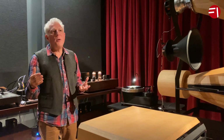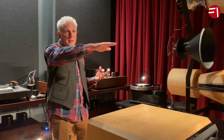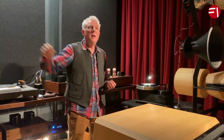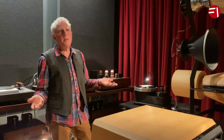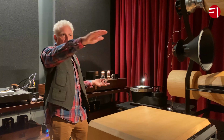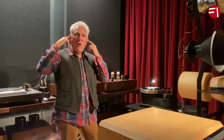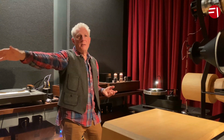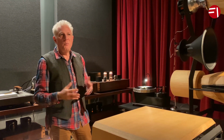In fact, one problem with the audiophile understanding of what sound should look like from a frequency response standpoint is this misnomer that the flat line, like a dead person's EKG, is the correct frequency response for a loudspeaker. And that's not true at all. If you look at Harry Olson's Elements of Acoustical Engineering, which was the textbook for most of the 20th century, you'll see that from a psychoacoustic standpoint, the way we hear, right? So our hearing is not microphones hooked up to a computer. Our ears and our brain are an active system, and a loudspeaker's response should look like this, which is a shallow saddle shape, and that provides the most correct, natural, and lifelike sound. And that's what we're aiming for.